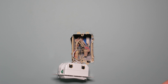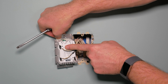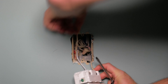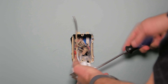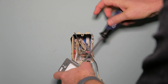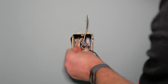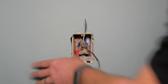In this case the screws are flat or Phillips. You'll see this switch I'm removing today actually has three wires going to it — a hot, a load, and a neutral. There's a good chance yours will only have two wires: the hot and the load. The white wire you see here, there's a really good chance you wouldn't see that in your switch. If you do, great. If not, when you open it up you'll just have two wires — kind of like what I'm going to demonstrate by removing that extra white neutral wire.